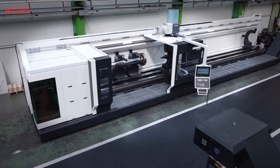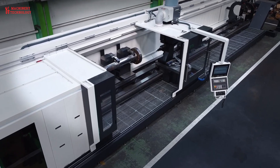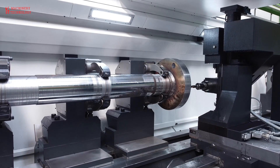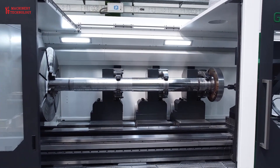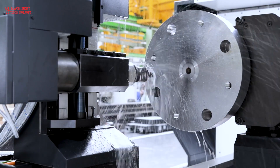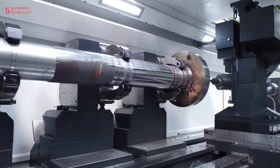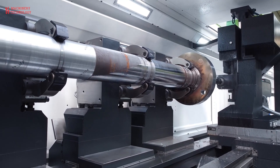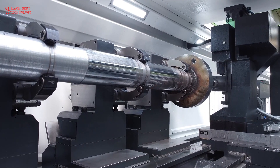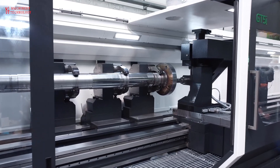The motor rotor shape is a cylinder mounted on a shaft. Internally, it contains longitudinal conductive bars, usually made of aluminum or copper, set into grooves and connected at both ends by shorting rings forming a cage-like shape. The name is derived from the similarity between these rings and bars winding and a squirrel cage. The rotor bars may be made of either copper or aluminum. After being cast into blocks, the rotor shaft will be turned using specialized lathes. On these automatic lathes, workers only need to attach the shaft to the machine and customize the parameters — everything will happen completely automatically.